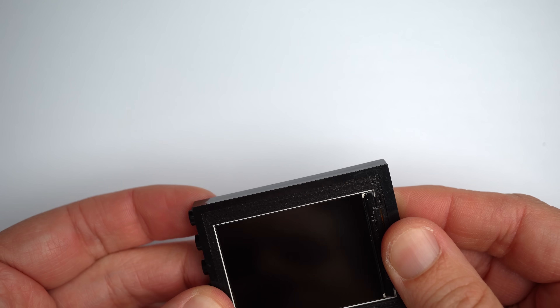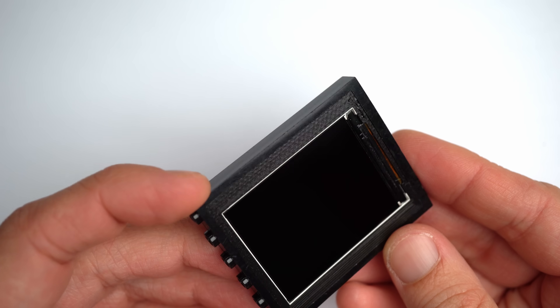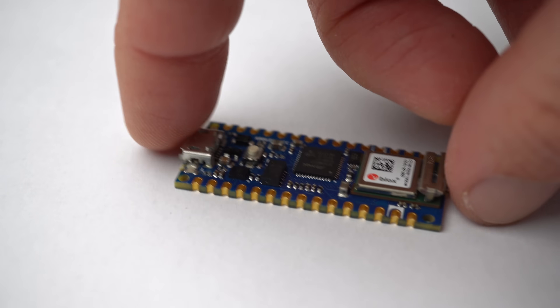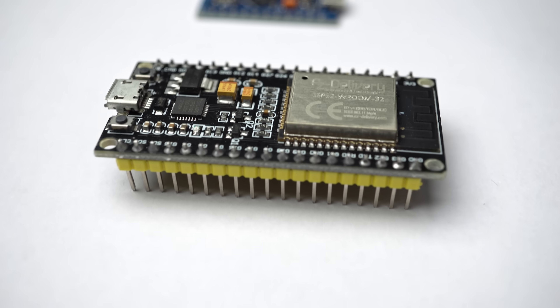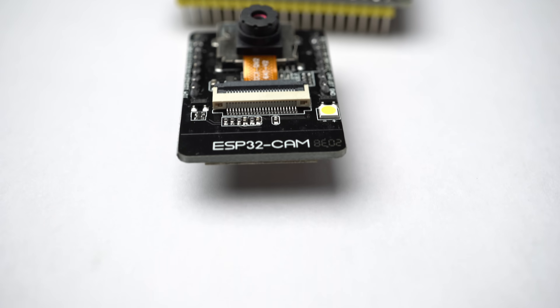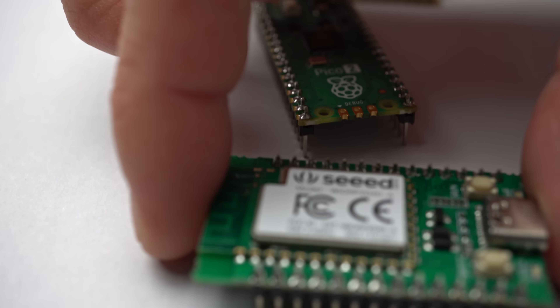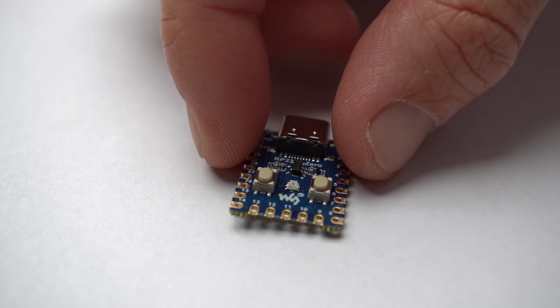Of course, if you do not have a 3D printer, you could cut something similar from black cardboard. Next we will need a way to drive the display. At this point you get a lot of options, because this is a simple SPI-driven display and you could use almost any microcontroller or Raspberry Pi in combination with many open source projects. Larger boards would require you to keep the microcontroller on the outside, so instead I got a tiny RP2350 and tried to keep the setup compact.